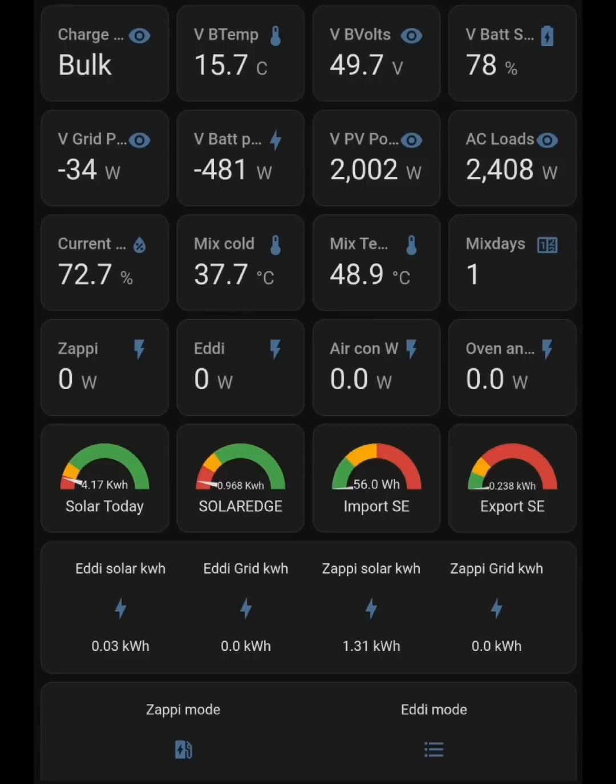I don't like those tenths of a kilowatt hour that keep getting consumed, and the more EV charging I do, the more overhead and grid draw I have. So I thought I'd do a test today — the difference between using a granny charger, which is a fixed kilowatt charging rate that the battery and solar can handle more stably, versus the Zappi. I'll also look at adjustments to my home storage battery, the DVCC charging characteristics on the Victron, and how that controls energy going into the battery versus other things.